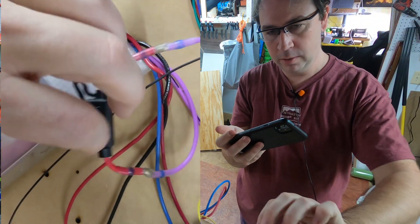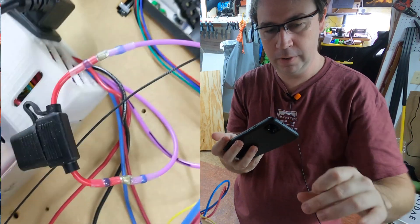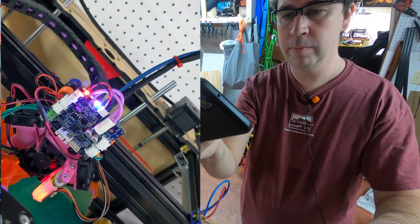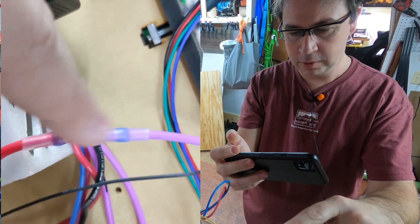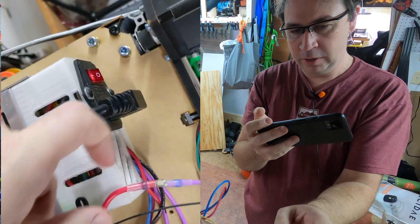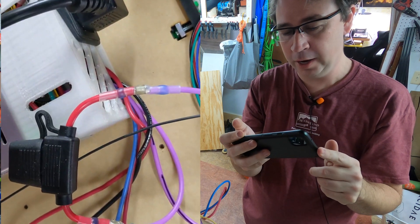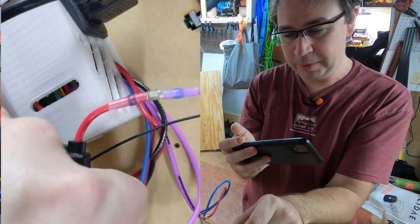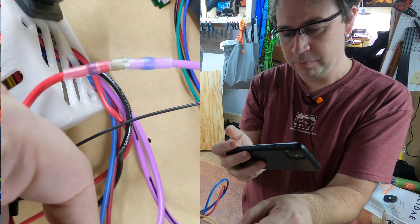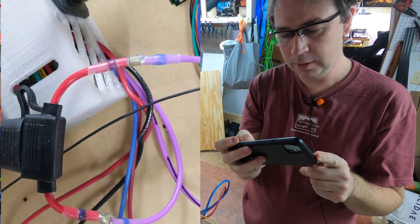That is the quickest way to add a fuse in. I'm going to mount the fuse and verify that it works — still got sync, still got power, doing good. One thing: anytime you're running a solder joint, you should put a multimeter on either end and make sure you have good conductivity so that you haven't added any resistance to the system. If you have a bad solder joint, it might have enough power to light it up but cause problems with arcing down the line. Happy printing, thanks for watching.